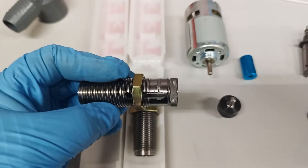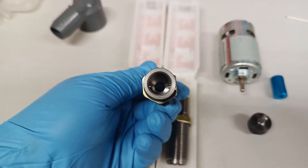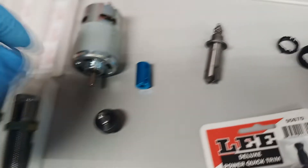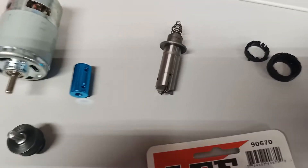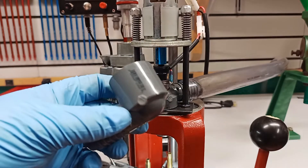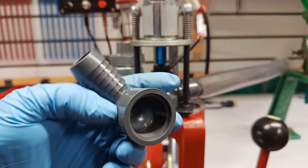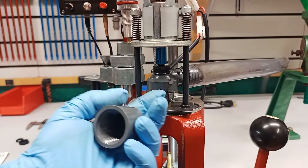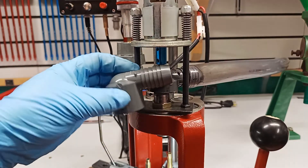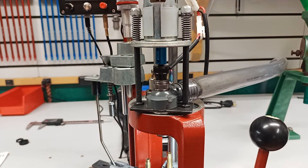In order to evacuate the chips, slots were machined at three-sixteenths of an inch, 180 degrees apart, going down two-tenths of an inch from the bottom of the cutter. Where the cutter rests inside the die, it leaves a cylinder in the bottom for the cutter to rotate in, preventing chattering or damage to the die. To exhaust the chips I started with a PVC pipe fitting — the inside was machined out to fit over the press body and over the press die, then shortened to sit tight against the press body.